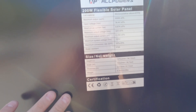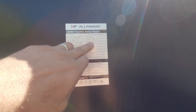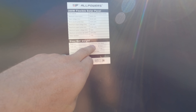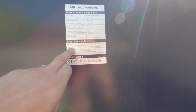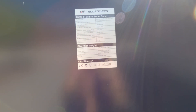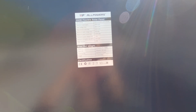Just to give you some stats on the flexi panel: it's a 200 watt flexi solar panel. Open circuit voltage is 38.4 volts plus or minus 5%. The size of the panel is 1375 millimetres long and 780 millimetres wide, plus or minus 2 millimetres. The weight is only 4.1 kilograms, so it's really, really light. The only difference with this one is you can't fold it up, so putting it in the van you need a decent sized boot, or fixing it to your roof would be ideal. It has got some velcro cleats so you can fix it upright to something or just lay it flat on the floor.